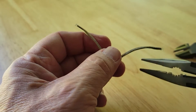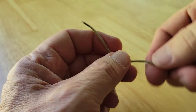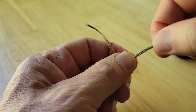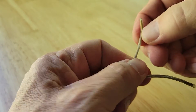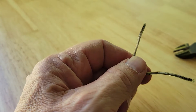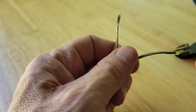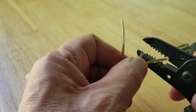Then I'm going to pull it apart, and if it's hard to pull apart that's where the long nose plier comes in — you can just grab one end and pull. When we look, we see that this is fully wrapped in insulation and so is the other one, with no wires exposed. So now we're ready to go in with our wire stripper. This is 16 gauge, so I line it up with 16 gauge.